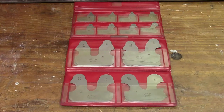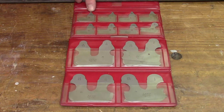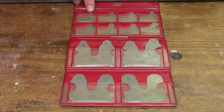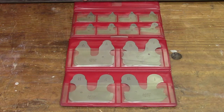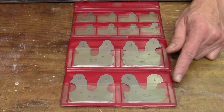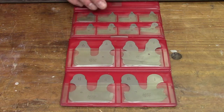Here is the set of radius gauges that I purchased. They're from Lufkin — I believe they were made in the 1960s. They're constructed of stainless steel, which I find desirable. They're available from a wide range of manufacturers, both current and used, and in a wide range of prices. If you're patient you can pick them up on eBay very inexpensively; I paid $16 including postage for this set. This particular set I think is the most useful for woodworking — it runs from 1/32nd up to a half inch by 32nds of an inch. There's also a set that goes from 1/64th to 17/64ths by 64ths, but I don't see a lot of utility for that in a woodworking setting. And then there's a set from a half to 1 inch radius by 16ths, but this set is going to cover the vast majority of woodworkers' needs.